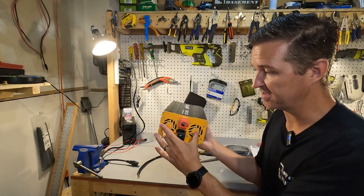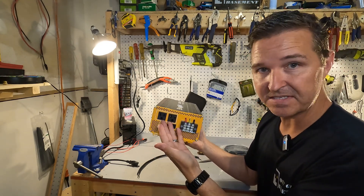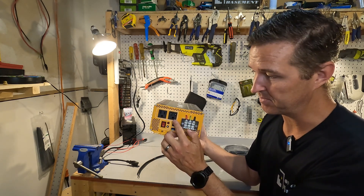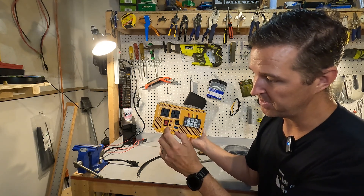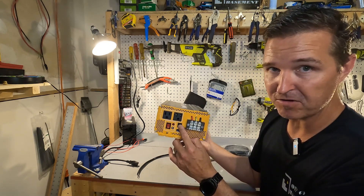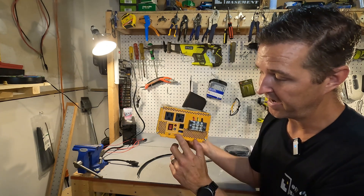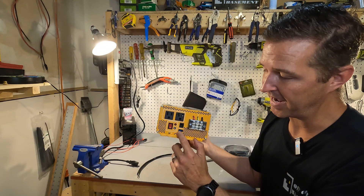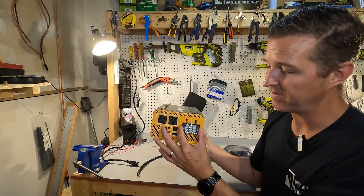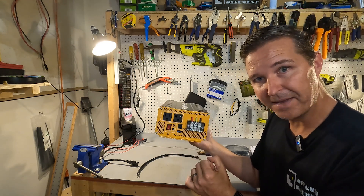There are also two fans on the sides. On the output side we have our two AC receptacles — one is a 15-amp receptacle and the other is a 20-amp receptacle. We have our on/off switch, a fault light, a power light, a 485 communication port for connecting to the remote, and also a 5-volt 3-amp USB-A port. What's nice is we also have a hardwire connection so you can actually connect this inverter to like a small sub-panel.